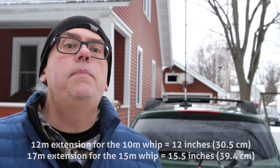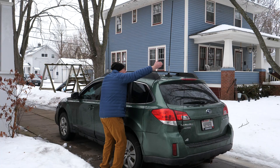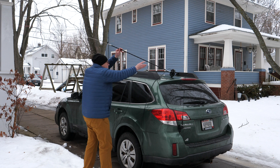Now these lengths are approximate and will really depend on the tuning lengths of the whips — you may need a little less or a little more. Using an antenna analyzer will help you find that sweet spot for your particular setup. For example, the extender to get onto the 17-meter band was initially 15 and a half inches, but for my 15-meter Shark stick I needed 17 inches of extension total. So the numbers are just a starting point. Cut them a little bit long when you start out, and then trim them back as you tune them up.